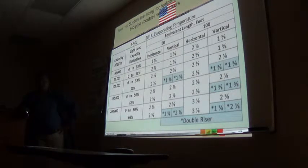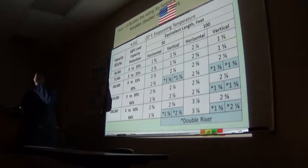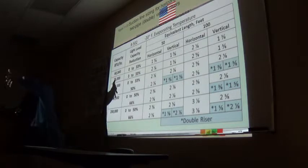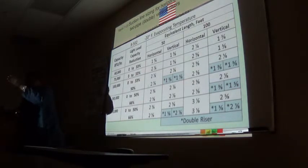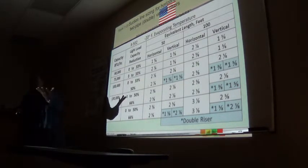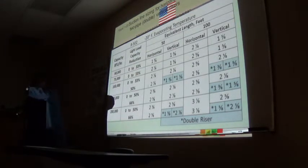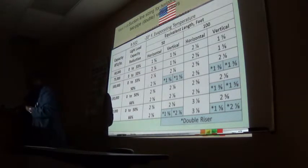But if you want to get really into it, every substance has a specific heat. So you will ask them, okay, how many pounds of vegetables, lettuce, do you see yourself having in here? 20 pounds. Lettuce has a specific heat, X, Y, Z. Then how many pounds of cabbages, how many pounds of carrots? You go point by point, find a specific heat, and multiply that by the pounds, and you get the BTU load requirement for that. You add it up plus infiltration plus whatever, how many times you open the door.